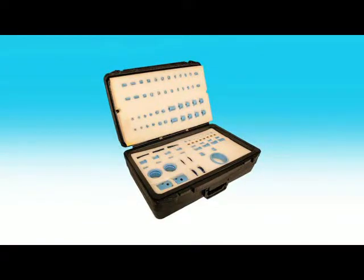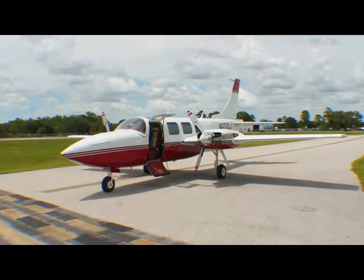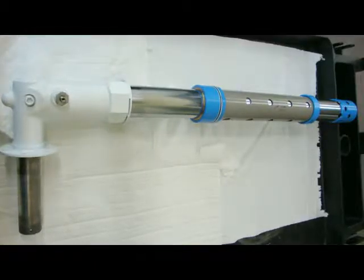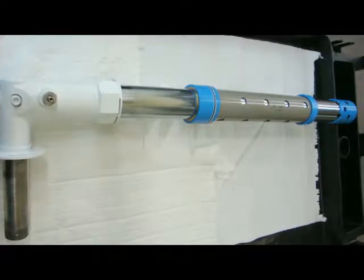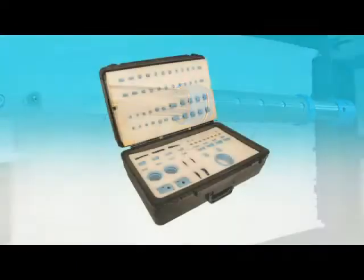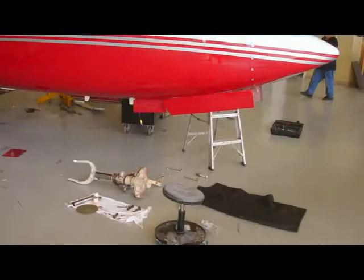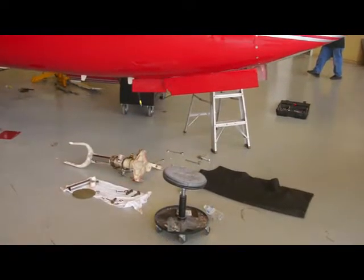We're going to show the steps involved with the removal and replacement of an Aerostar main landing gear and nose gear that's been overhauled by Marsh Brothers Aviation. The gear has been stripped, NDT inspected, and all factory bushings have been removed. New Aerotuff grease-free bushings have been fitted along with Thorflex seals and wipers, replacing the OEM O-rings. These photos were taken by Jimmy Mullen at his Aerostar maintenance shop in LaBelle, Florida.